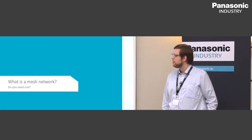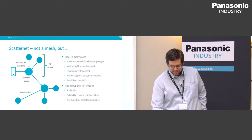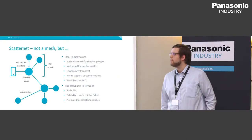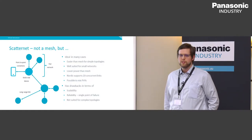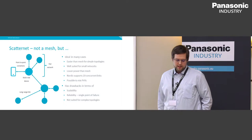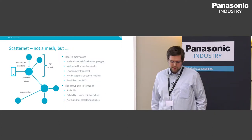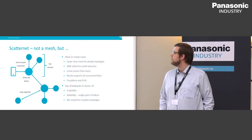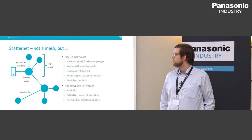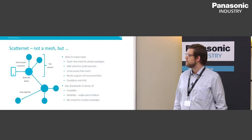I'll start with what is a mesh network and do you need one. In Bluetooth 4.1, something called a scatter net was defined. This is not a mesh network, but it's multiple star networks where you can form connections between many nodes from a central to a peripheral. This is well suited for small networks and typically gives you lower power consumption than a mesh solution because it uses Bluetooth Low Energy connection-based operation. With the Nordic solution, we support up to 20 concurrent links, and it's possible to mix different PHYs — long range links, one megabit, and two megabit mode — all in the same network.